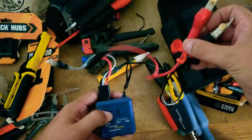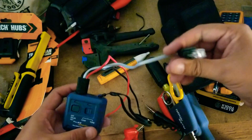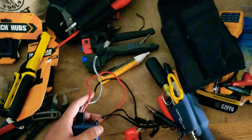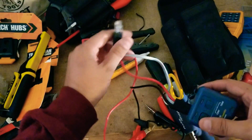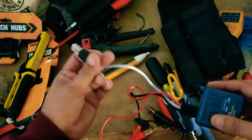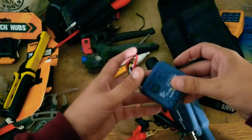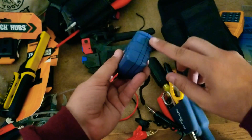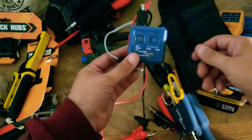Another thing is you can plug directly into a jack. The thing that sucks is if you've got a phone covered up by a desk but you have the phone cord right at the phone. What you can do is get a coupler and plug into that, and it will run through to the faceplate — you don't have to move any furniture. Normally what I do is find a really good coupler and super glue it to the bottom so I'll always have it.